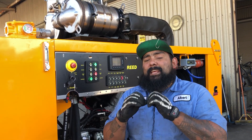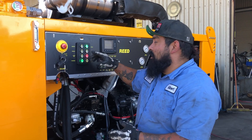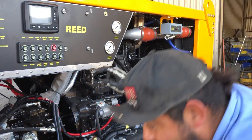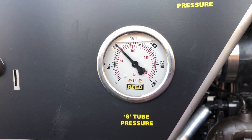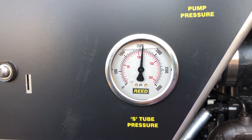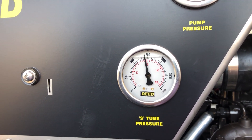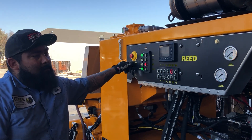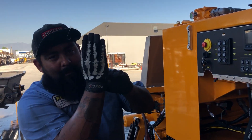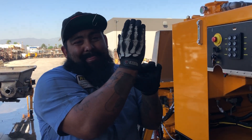It's not a precise reading but it gets you in the ballpark, so you'll know if you're at 300 psi or a thousand — you're supposed to be in that range. Watch this gauge right here, the swing gauge. You see how when I honk the horn it jumped to a thousand, finished charging, and then when I dropped e-stop it bled slowly to about a thousand and then dropped quickly. That means your accumulator is about a thousand psi, which is what we said.